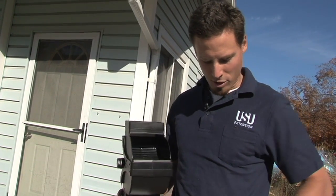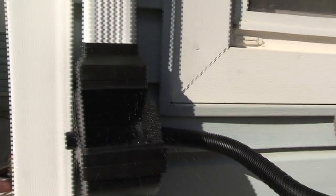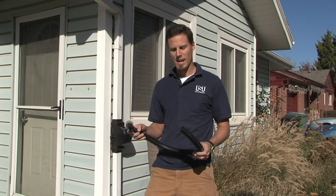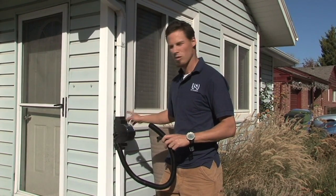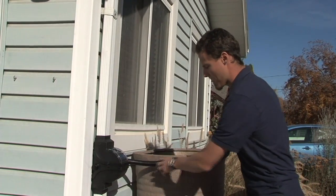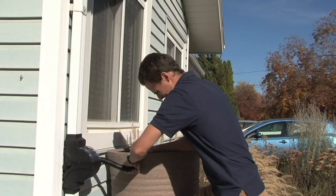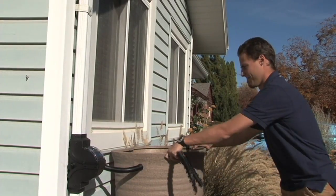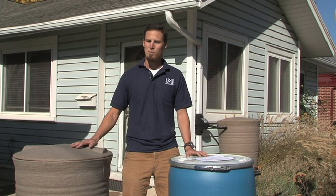This one comes with a handy plastic cover so you can cover it up and look in to see if there's anything blocking your downspout. The final step is to connect the tubing from the diverter to your rain barrel. This diverter has ports on either side, so I'm going to put this one on the far side. We'll measure the length of the tube, cut it with a utility knife, insert it, and connect it to the downspout. I'm Brian Green for USU Water Quality Extension — if you have any questions we'd be more than happy to answer them.